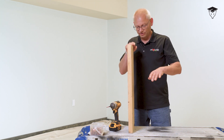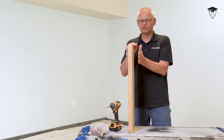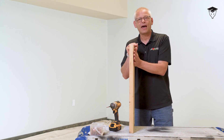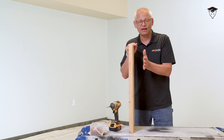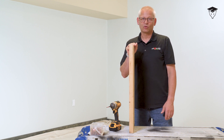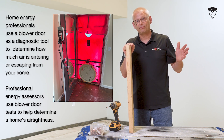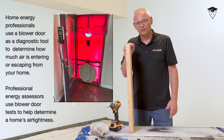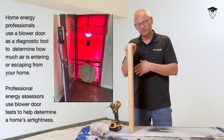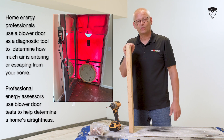What happens is you put this up, you got your ICF up, you pour concrete into it. The concrete comes up against the wood, the wood swells because it's absorbing moisture out of the concrete. Then it shrinks back, and the concrete as it cures will have that slight shrinkage. You get a really nice gap all the way through. And when you start doing a blower door test — which in some code bodies is mandatory now — you fail, because you've got infiltration and exfiltration going on nonstop. The wall is breathing through this gap.